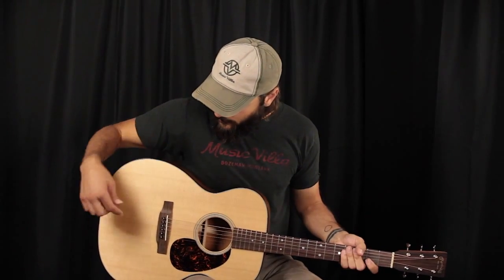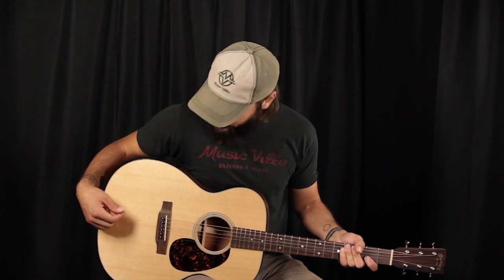Now you're asking me, okay Tone, it's a triple O18 — what'd you do different? It's all under the hood. What we have is 5 sixteenths inch golden era style bracing, with the last tone bar being a quarter inch. This opens up the top tremendously. You can dig in really hard — it responds great. You can pick lightly, and it responds equally as great. Also, to add to the responsiveness, the top is sanded a little bit thinner.